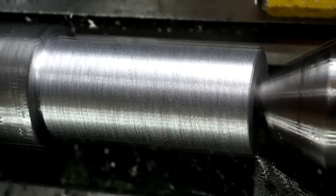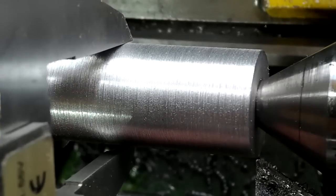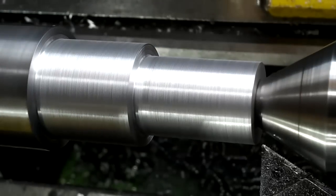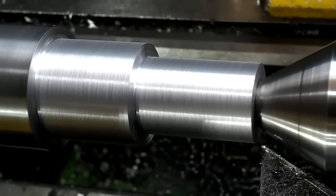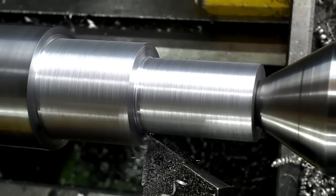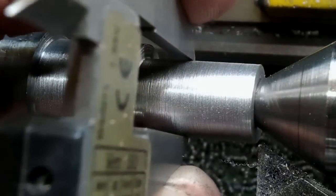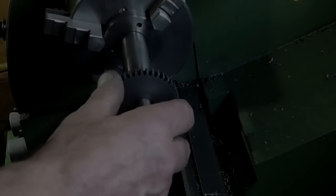The other end of this indexing shaft I'm putting 2 spigots, one at 20mm, the other at 14mm. Then after cleaning all the dimensions up I've used a couple of my lathe change gears to test the fit. There, that's good enough.